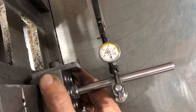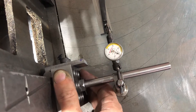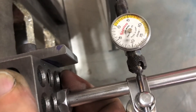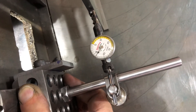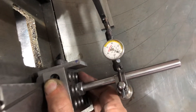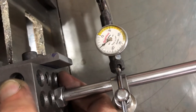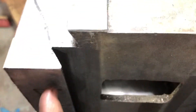It's all over the place on the bottom — it's 15 thousandths off in eight inches. Going back to zero, and that pretty much exactly matches 15 thousandths over eight inches. That exactly matches my previous reading that I took with the knee in the mill, so this measurement confirms my previous measurement.